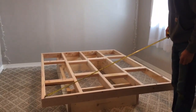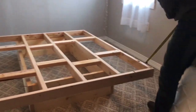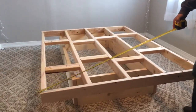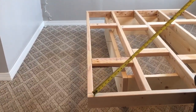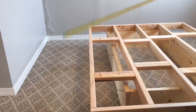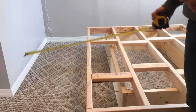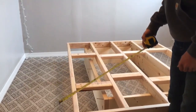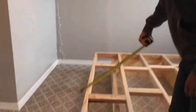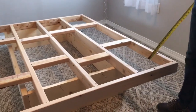Notice this 2x4 — it comes all the way out to the edge on both sides, so that would be 56 inches. This side 2x4 right here goes in between this 2x4 and that end 2x4. So instead of cutting 75 inches, you subtract 3 inches because each 2x4 is an inch and a half thick — inch and a half plus inch and a half equals 3. Subtract 3 from 75, you get 72. So this side 2x4 is 72 inches, and you have to cut 5 of those.